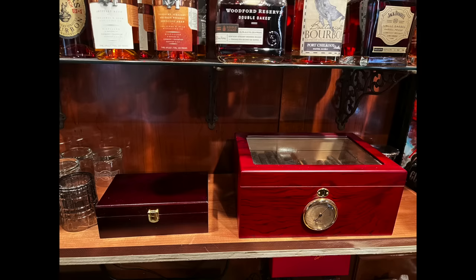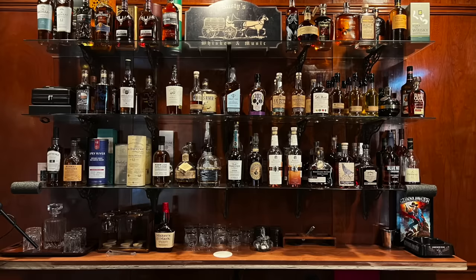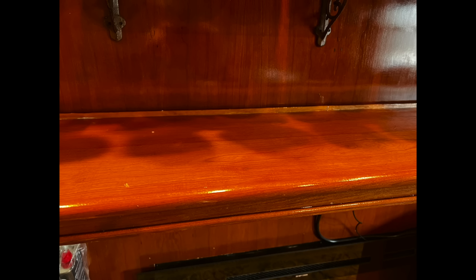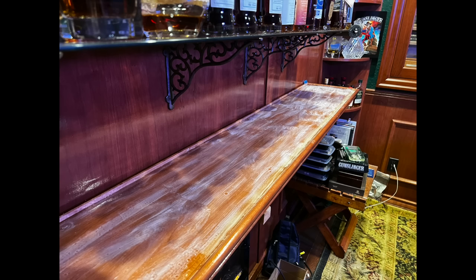The bottom shelf, which serves as a bar top, is comprised of 2 1-by-6-inch cherry boards attached to a 3/4-inch plywood sheet, so the total thickness is 1 3/4 inches. So I stained the top cherry boards to match everything else, then added a chair rail on the front and sides to provide a finished look. I wanted a glossy finish on the top, so I chose to apply epoxy in layers. It's about 1/4-inch thick epoxy top coat.